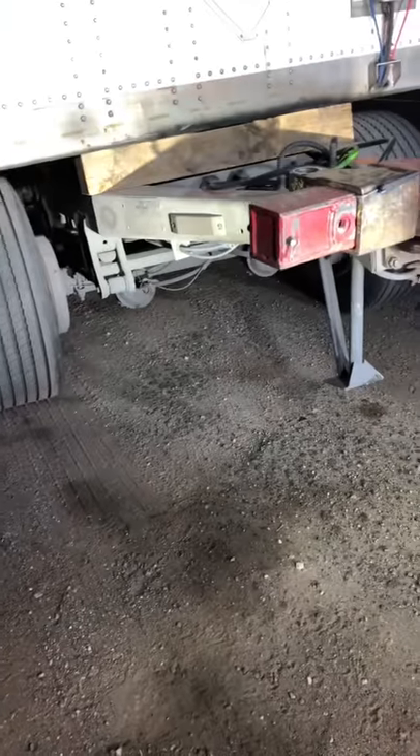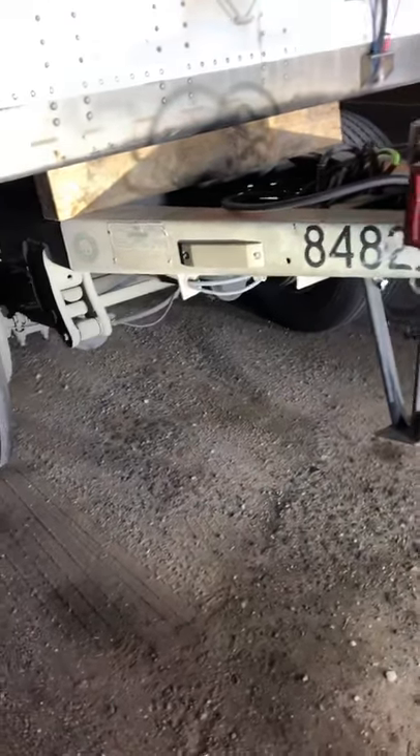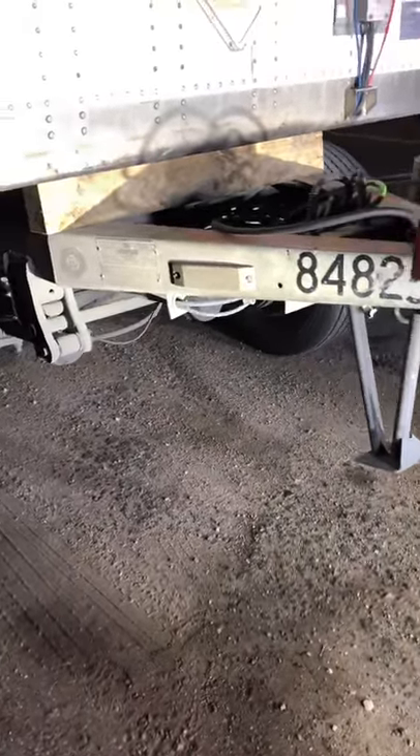Got the nose of it picked up now. We're gonna work on straightening it out - it ain't got to be perfect right off the bat. We can line it up better once we get the chains and binders on it, but try to at least get it a little bit straight before you throw the chains on it. Now that I got the timber on the back side, I'm gonna push down on the nose of it and put a timber under the front side to hold that con gear from nosing up too hard. If you don't block it on both ends it has a tendency to stand up with the nose straight in the air - it'll be a pain in your ass.